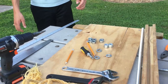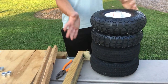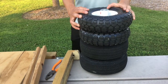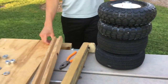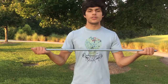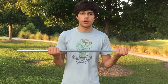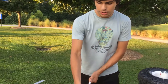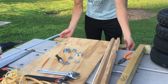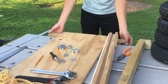Next you're going to need tires — two of these for the back and two for the front. These are 10-inch pneumatic tires that you inflate at 30 PSI, which you can probably get at a hardware store. Next you're going to need two 36-inch long 5/8-inch rods. Since the tires have a 5/8-inch bore, you have to basically do everything 5/8 of an inch. I also forgot to mention there are actually seven nuts total, because there are two additional nuts and two additional lock washers for the back as well.